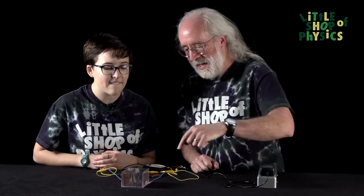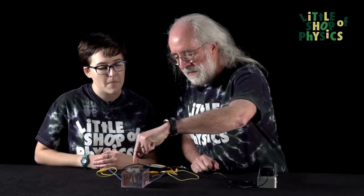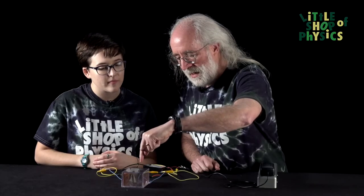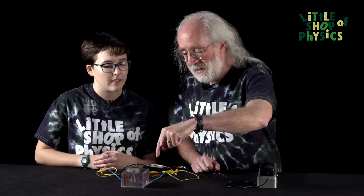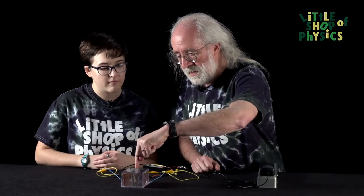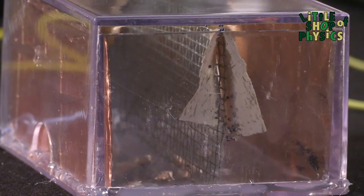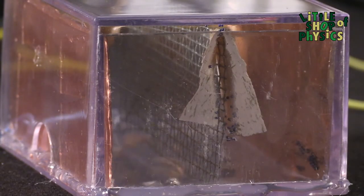So if I had to guess what's happening, it looks like there's an electric field inside here. And then I have little conducting bits — they're going to get attracted to this plate here which is charged, because if you have a charged object, little conducting bits will all be attracted to it. Then they touch it — but now they get the same charge as it. So they have to get repelled, they bounce to the other side. Then they touch that, give their charge away, and get attracted back. They're just transferring charge back and forth.